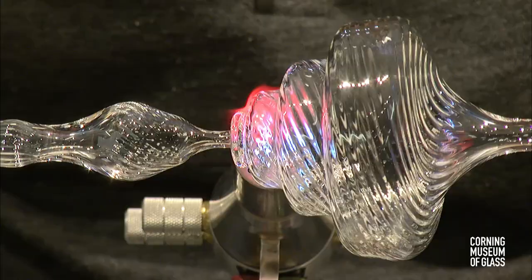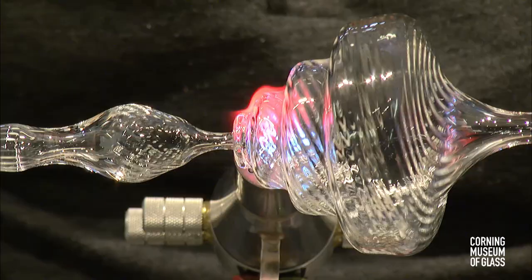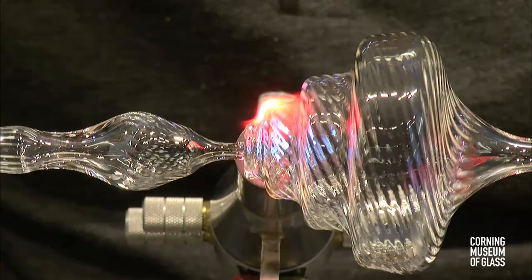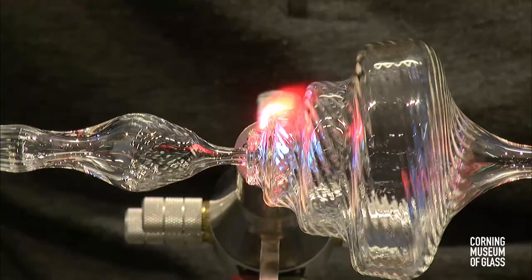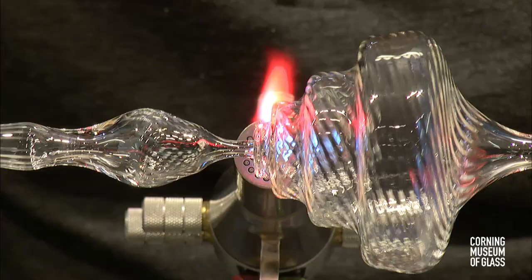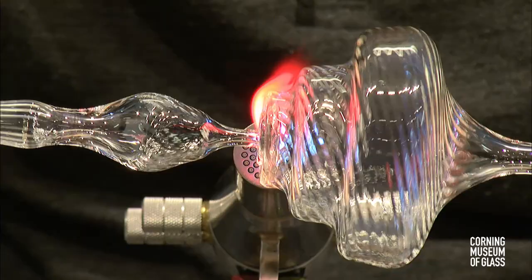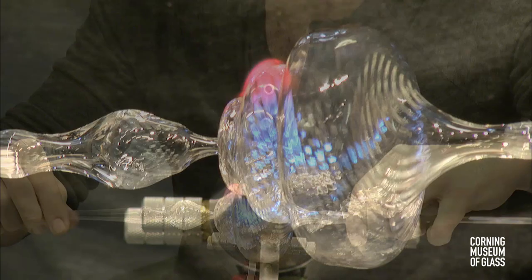So there's a kind of a misconception about these inverted forms, about how I do them or how they can be done. There's a couple ways. I can just heat this and stretch it inwards. But what I'm trying to do, heat this edge until it loosens up. I feel it loosen, I can push, I can feel it pushing in, and I can just push and stretch it in. But instead of stretching it in, once it starts to push inwards, I'm going to transition my flame from that sidewall to the outside and try to get that material to fold under instead of stretch, if that makes sense. So I go from heating this wall to get it to push, second one.